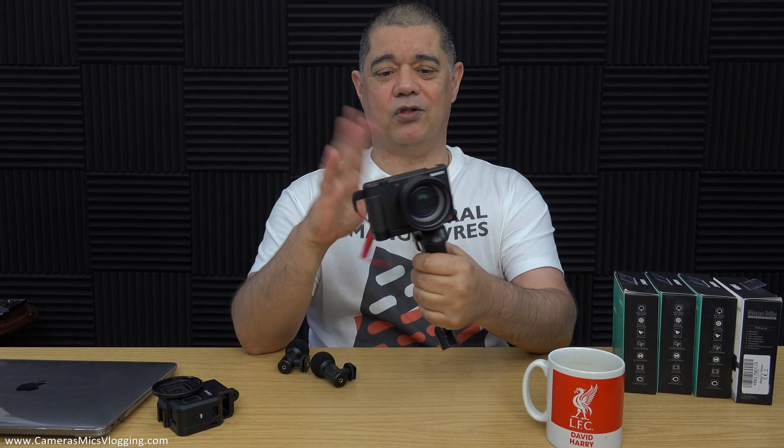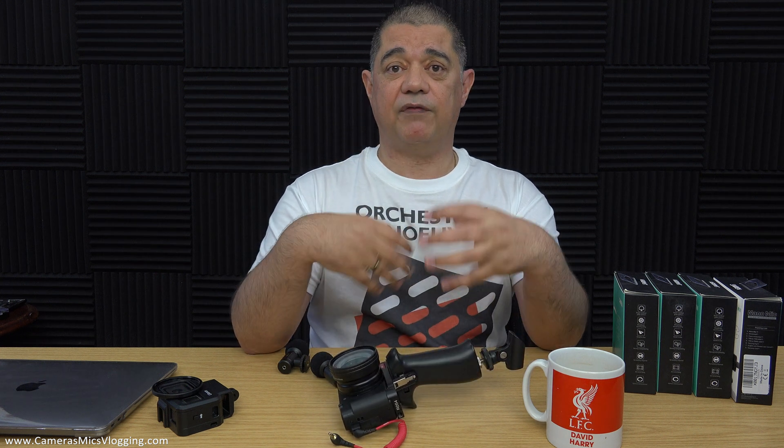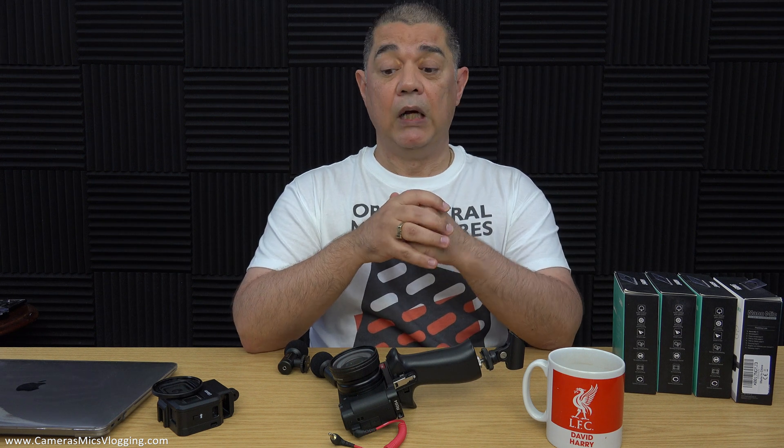There are four of these Sairen mics — I ordered five but only managed to get four. Over the course of the next month or so I'm going to be butchering more of them. I'm going to try two omnis on a spaced stereo bar for wide stereo — dare I say what we'd call fake binaural. That basically means using two spaced omnis in the correct position without the dense mass in the middle which emulates the human head. I'll be doing that so I can stick it on top of a camera. And a few other things with different cardioid capsules too — I'll probably mostly stick to Primo.